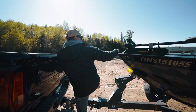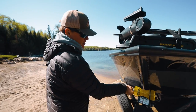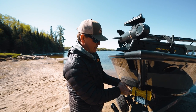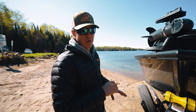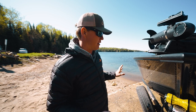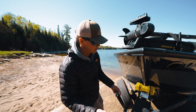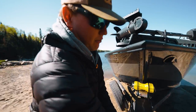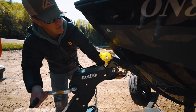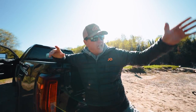All right, we made it to the lake. We're gonna try out the Drotto for the first time. I'm told it's good to take the handle off when doing any long trailering, so we're gonna throw the handle on. What I'm gonna do is disconnect the chain and the main latch. If you have a roller boat you do not want to do that until the boat's floating — that's still full liability for you if the boat comes off the trailer obviously. So I'll disconnect it here close to the water, then once I'm floating I can just pull the lever. I'm gonna back it up till I'm floating, hop in, pull the lever, and she goes.